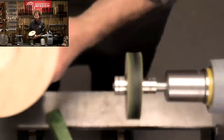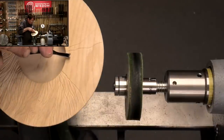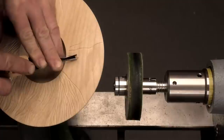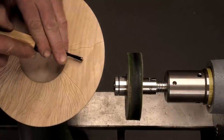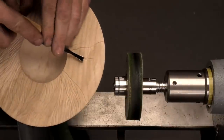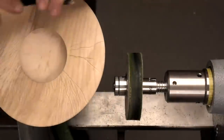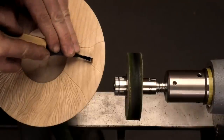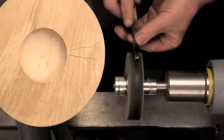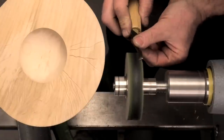Now the joy with this is, if you think about it, come back to there now, let's have a look. A bit better. Got to come across the grain nicely now. Trying to control it. Let's bend it back up. Come down through there. I'm leaning across the lathe a little bit, but what I'm getting at with this is a setup. Getting a little bit blunt again. I can go straight back into here. Let's do inside of the V.